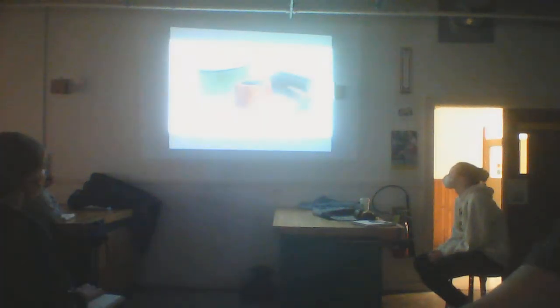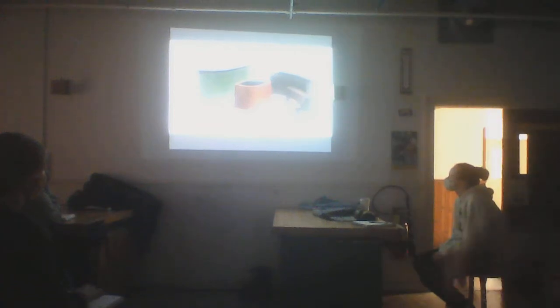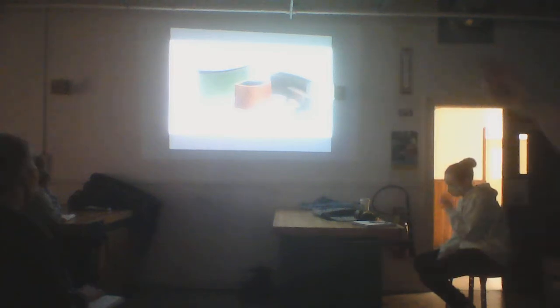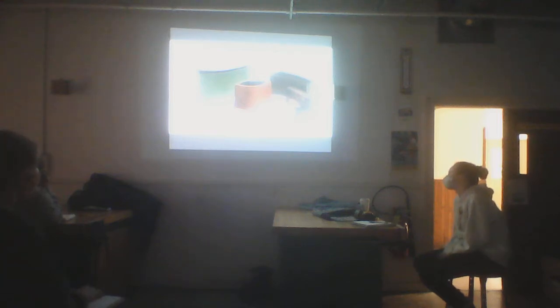Here are more of his pieces. He does a really interesting thing where he doesn't cut the sides from the ends. He cuts the sides from themselves, essentially, and does it with a curved cut that's at an angle, not a curved blade. So he tips the bed of the bandsaw to achieve kind of a drum-like shape where it's hollow, parallel all the way down. The piece on the right there, the brown, that's barely visible, is made out of Claro walnut, which is a kind of California hardwood, and each smaller box is made from the previous interior cut. So they nest, ultimately.